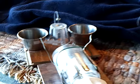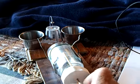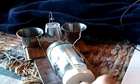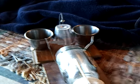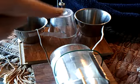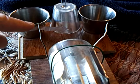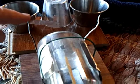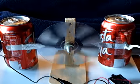And this is what I've done before. This is a typical electrostatic motor with a little handmade generator. Let's see if I can get this one to go. There it goes. And that's the same idea. It's got a charge on one side and a charge on the other side. Like charges repel, opposite charges attract, and then the little brushes tap the rotor and switch the charges on the plates. And that's how that works.